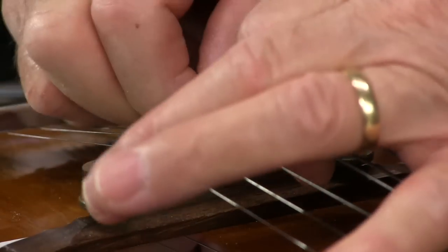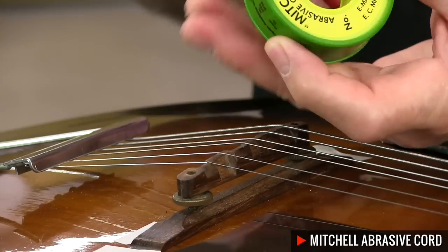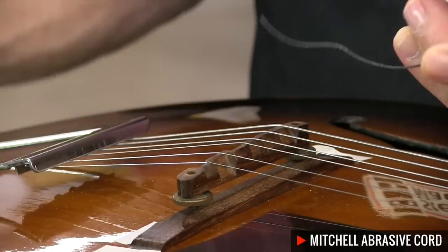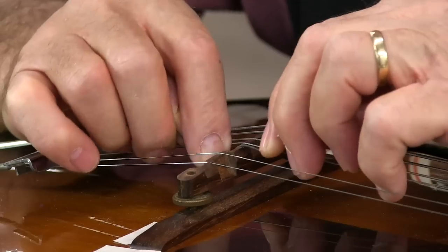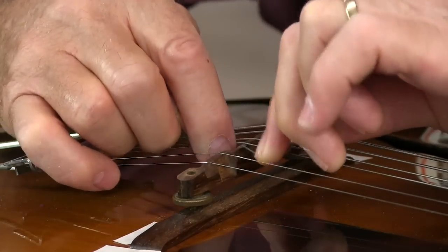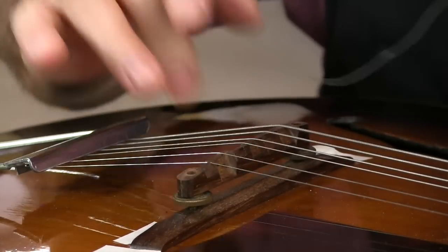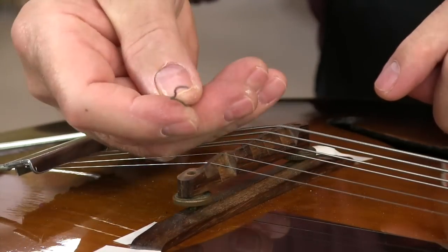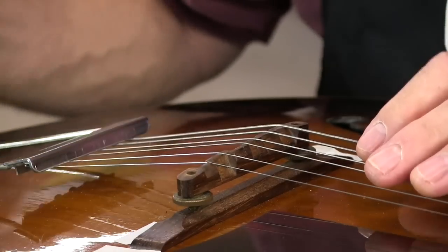That's a good start on the D — I can make it a little cleaner. This is a Mitchell abrasive cord — imagine a string with a sanding grit on it. That comes in after the files and does a great job of adding roundness because it's a round string; it smooths and rounds all the marks. It's a really good finishing touch. That's all I need on this bridge — it's very hard Brazilian rosewood. Sometimes on a softer wood I might follow this with dental floss or a different piece of string to burnish it and make that wood hard.